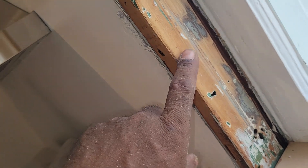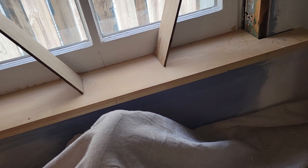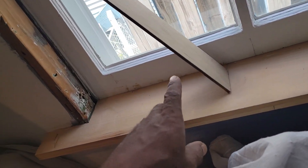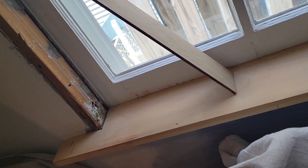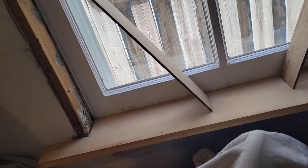So I got this scraped down to the wood. Because it's over the sink, we do have a storm out there that's going to help, but I see it's not airtight. So this area is going to be a lot of humidity. And if I was to just take this board and just nail it up here, most likely this will waffle, swell, move — I don't want to say fall off the wall, but it'll look like shit in about a year.